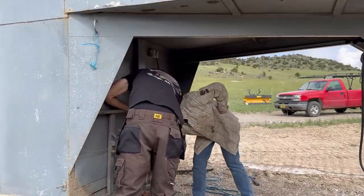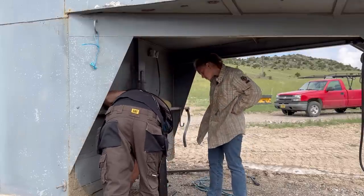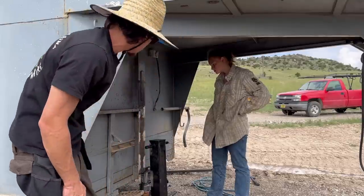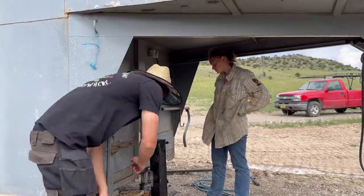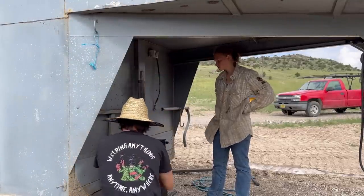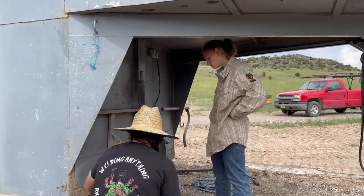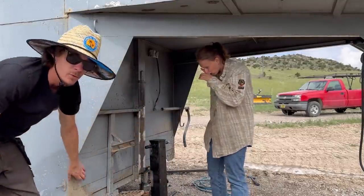And the other thing is you could do it right there. You got something to grab onto. Now do you, I don't think it's going to be in your way, but would you think that's going to be in your way while you're trying to weld? Yes, it would. Okay. So maybe try to look for a further point, maybe right here? Okay. So go ahead and ground that up then. And then we'll go ahead and we'll use that as our ground.